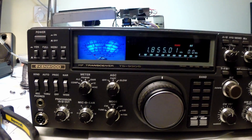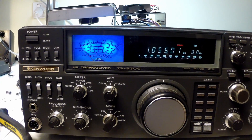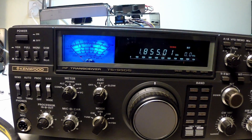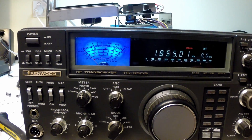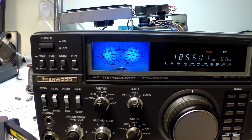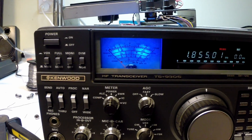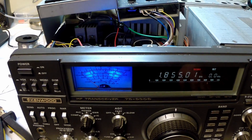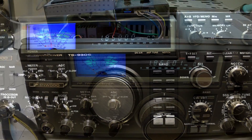I think that looks quite good. We've got the brightness right. It's the bright LEDs with a 3.6K ohm total series resistance for current limiting. The resistors run a little bit cooler, the display is not overly bright, and a little bit of scuffing of the LED lens has diffused the light a bit better, making it a far more pleasant display. We are now going to put the radio back together again and put it back in service. Thank you.